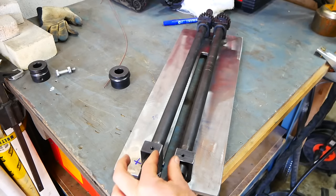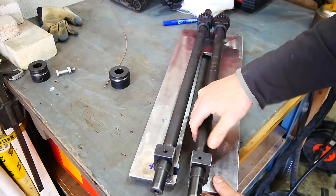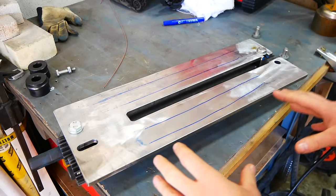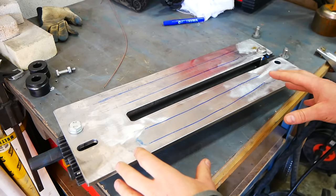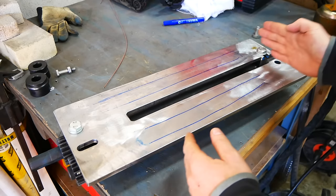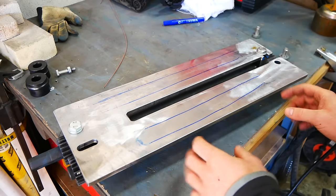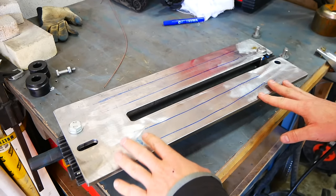So you can see now there's a lot more space between these two parts. That's good. Also in the frame, maybe you know that there are some really nice bead rollers that have a sliding adjustment on one shaft, so you can slide one die above the other one and have some adjustment there. That is actually quite easy to do.